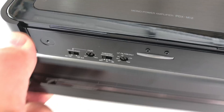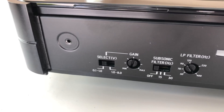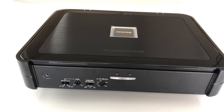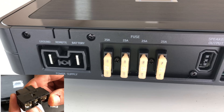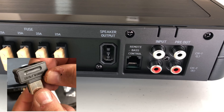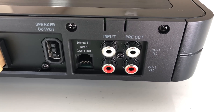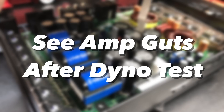Here we're going to take this little front access panel off to check the adjustments. We have a sensitivity select and a gain control beside that. It has a subsonic filter which is not variable — it's either 15 or 30 hertz. Then we have a low-pass filter which is variable up to 400 hertz. On the opposite side, we have the power plug and four 25-amp fuses for 100 amps of fusing. There's a speaker output plug which is easily removable. No remote bass control included — boo Alpine! And then we have RCA ins and outs via standard RCA jacks. Stick around after the dyno test to see the internals.